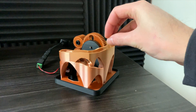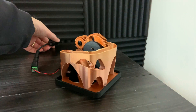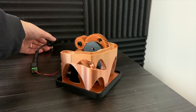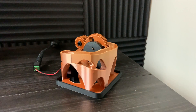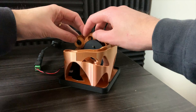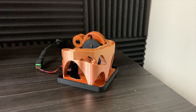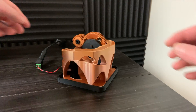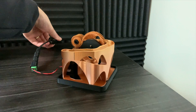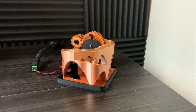I used some tape to help keep the alignment of the gears perfect. However, it wasn't quite right and the positioning wasn't exactly aligned. So I'm shifting the rotation of the top gear by one tooth at a time until the marbles are able to transfer from the bottom gear to the top gear. Here it's almost perfectly aligned, but you can see not every hole has a marble in it — this is probably because I'm off by one tooth. Now I've corrected it and every marble is transferring from the bottom gear to the top gear as it should.